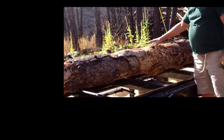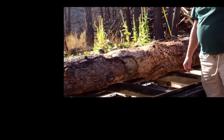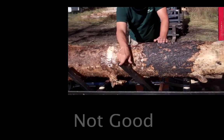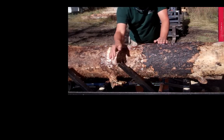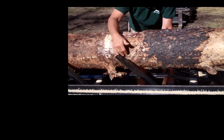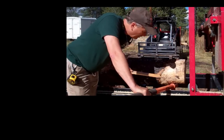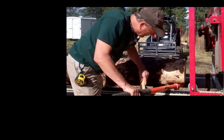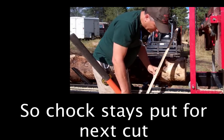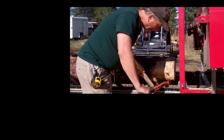The thing you've got to watch out for with the band saw is that if you run the saw into the stop, you'll end up dulling your saw blade really fast. On the first cut, I usually try to set the stop so it's going to butt against about the fat middle of the log. I've got about a half inch to three-eighths inch thick shim here, and this one is a little bit low. What I usually do is take my can hook and pry up the log. This is about a half inch wide, but I got a long one so I can lay it across the entire bar on the sawmill. What that does is when we turn the log over the next time, the stick is likely to still be there so I won't have to chalk it for the next cut.